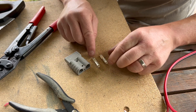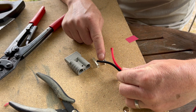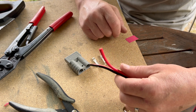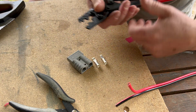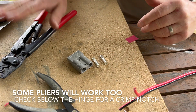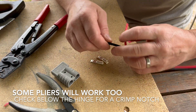The pins are agnostic of whether they're positive or negative — they're just a connect pin. You just need to make sure you put your cable in correctly: black is generally negative, red is positive. Some people solder these; in this case I'm going to crimp it with a crimping tool, so if you don't have a crimper then obviously this isn't going to work for you. They're not a vast amount of money and they're worth investing in.